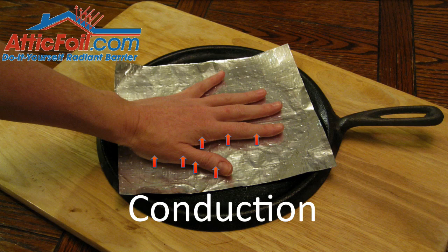Typically, a half inch or more is recommended. This is why you can never sandwich foil between two other products — if you do this, it'll actually work against you and increase the heat flow through the assembly by conduction. This is another reason why you cannot put radiant barrier foil directly under shingles, between the shingles and the roofing felt. It'll actually work against you, make the attic hotter, and increase heat flow into the assembly.